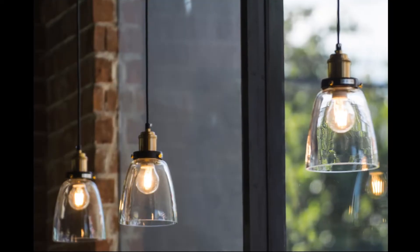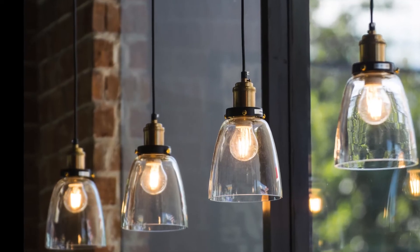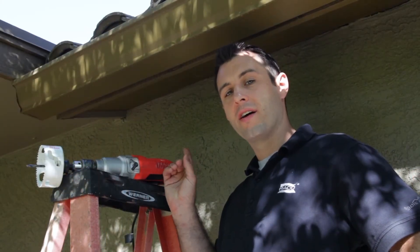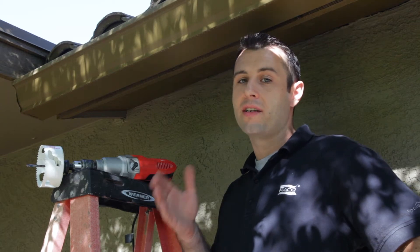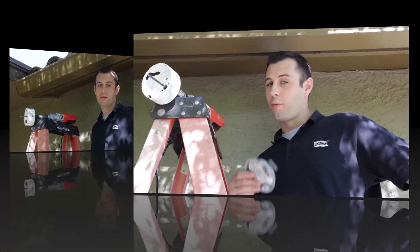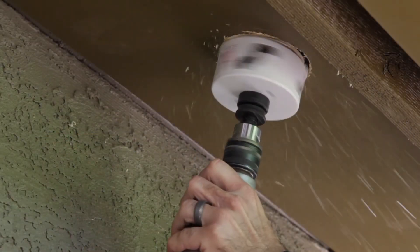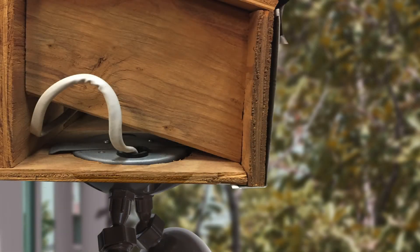Another great benefit of the 297 is when you have prior knowledge of an obstruction or a tight-fitting spot. Now you have the option of positioning the pan box exactly where you want it, not sacrificing the ideal location due to an impediment. Another example would be mounting a light underneath the eaves. Typically, I'd need to know the exact rafter location so I can either avoid them or use them to mount an electrical box. With the Rayco 297, I have the ease and flexibility to mount the box almost anywhere along the soffit board. Using a 4⅛-inch hole saw, I simply cut my hole in the preferred location. As you can see from this cutaway view, the 297 fits in nicely and without any issues with the rafters.